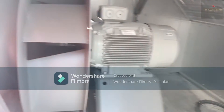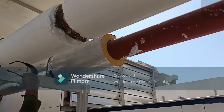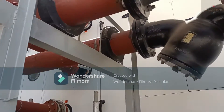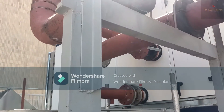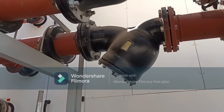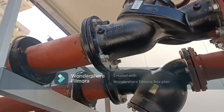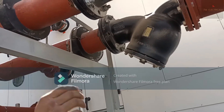The capacity of this unit is posted on the main nameplate. This is the chilled water coil, which plays a very important role in cooling the temperature. Inside it, chilled water runs in two circuits — one for supply and one for return. On the return line we will install one actuator, and through the actuator we can control the flow of chilled water; according to that, the temperature will be adjusted. You can see we have installed one actuator and this valve is for future freeze protection. The pipes are insulated to keep the temperature as low as possible.